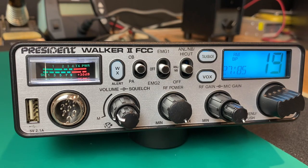I also really like being able to change the colors. The thing that impresses me most is how they have that one-piece all-aluminum chassis — the whole back part of the radio is a heat sink, so you're never going to have to worry about this radio overheating. One last thing: this has a timeout timer, a TOT. If you got the microphone stuck between your seats or you're sitting on it while driving, after three minutes the radio will unkey and give you alert tones. If you hear those tones, check for a stuck microphone — it saves you from burning this radio up. I've cycled this through three times in a row — nine minutes total — and that heat sink is probably some of the most effective heat sinking I've seen in a long time.